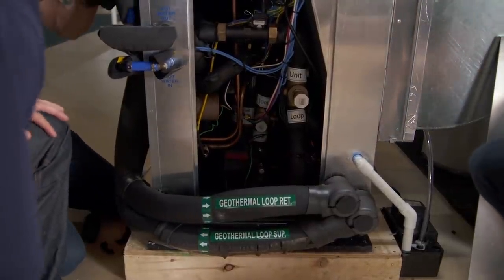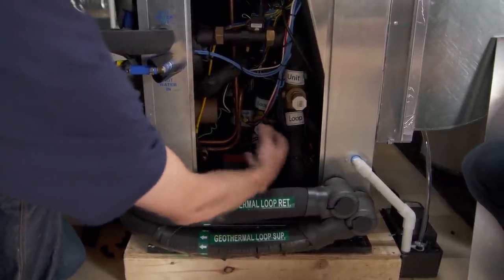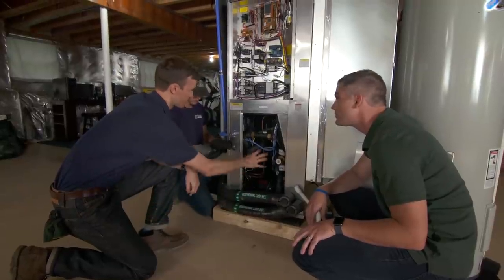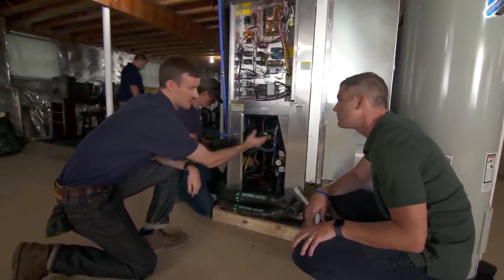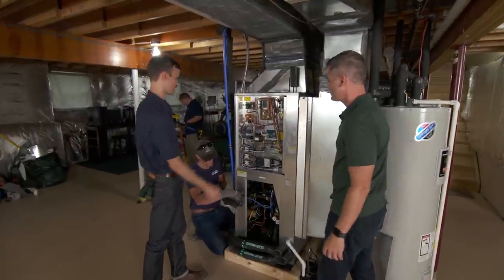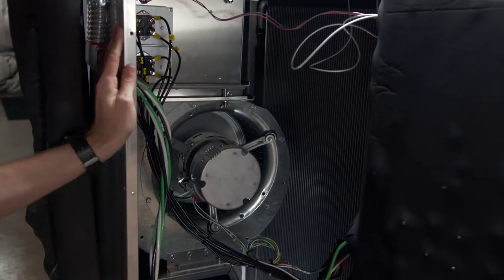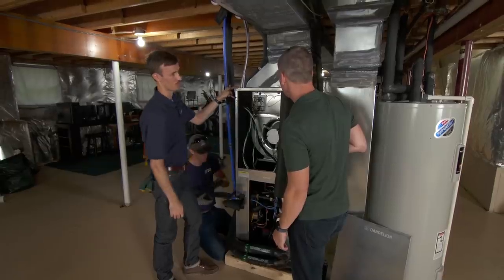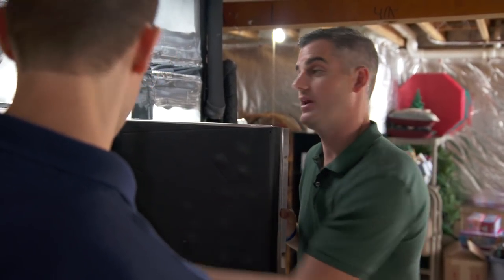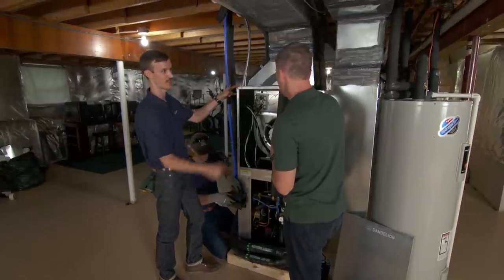What you'll see here is two pumps that pump through this piping out to our geothermal well, pumping a mixture of water and a little bit of glycol to account for any possible freezing conditions. That water moves through a heat exchanger inside the unit that exchanges with the refrigerant — all self-contained inside the box. On the air side, I see the return ducts coming in here — what happens next? This is just like any typical system where you're pulling return air across a refrigerant coil that the fan is pulling and pushing out through the rest of your existing ductwork. In wintertime, the cold air comes in right across that coil, warms up, and is delivered to the supply duct into the space. Then it's a continuous cycle where we go back and get more heat from the ground and pull it back to the heat exchangers.